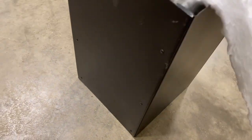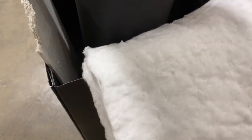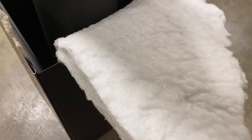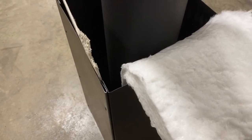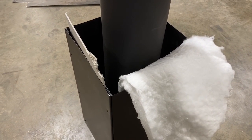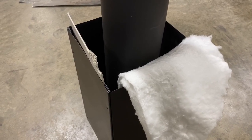This is a 10 and a half inch box — as you can see, really heavy gauge metal. What we do is we line the interior of it with the mill board and then we run our pipe through it. We pack it full of chimney liner insulation that is very similar to the mill board — you can put the torch right to it and it won't catch fire. We pack that full and then surround it with about eight inches more of this chimney liner around the exterior, just to ensure that added safety. Hope that answers your questions in regards to how we install the stoves and what precautions we take. Thanks for watching — if you haven't subscribed, please do so and hit that like button.